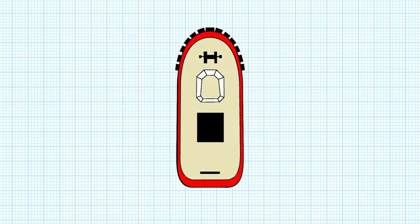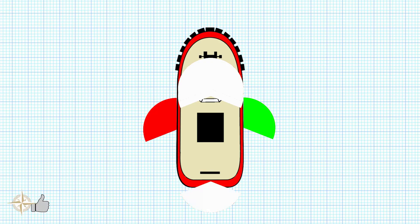Going back to our tug diagram: if a tug is pushing ahead or towing alongside, it's just going to have those two masthead lights, side lights, and a stern light — looking quite different to the tug that was towing a normal tow behind it.